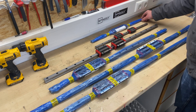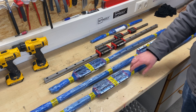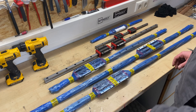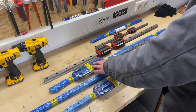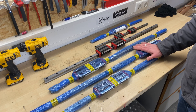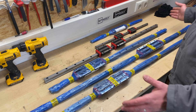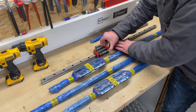What you are looking at for the bigger rails: 25mm build size, also long carriage flange style, slightly pre-loaded. The long ones are 1400mm and the shorter ones are 1 meter. The 1400mm rails will go onto the table assembly, and the 1m ones are going to be on the gantry beam.